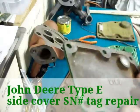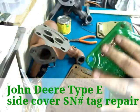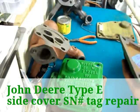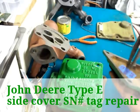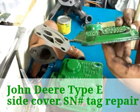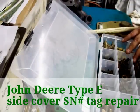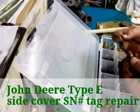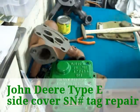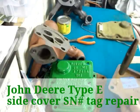If you're doing a rebuild or repair, I would just take them off, and I will show you why. The way I do it is I use this hammer here and just knock the pin from the back side through. Then I find a pin that is pretty much the same size, maybe just a little bit smaller. I'll set it right in there like so, and then just hit it. You see it went all the way through, so we know the tag on the other side is pushed all the way out.